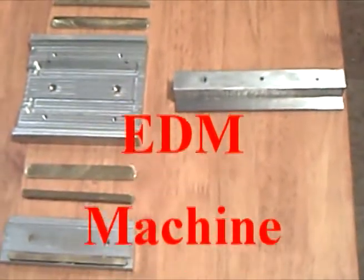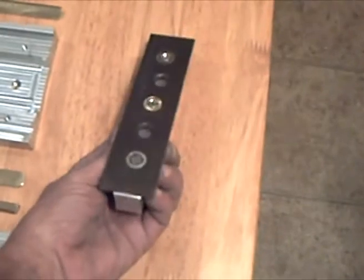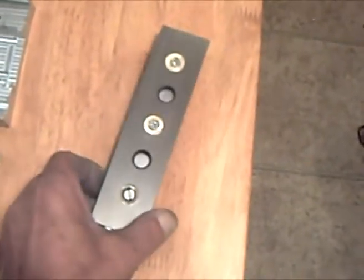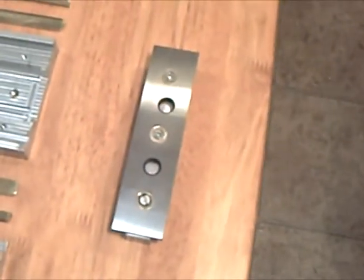This is the chronicle of building the EDM machine. You can buy precision parallels from places like Enco — get a set of eight for under 20 bucks. They're certified parallel to ten-thousandths. And so this will be the basis of a precision boxed way.